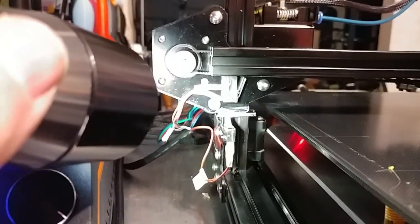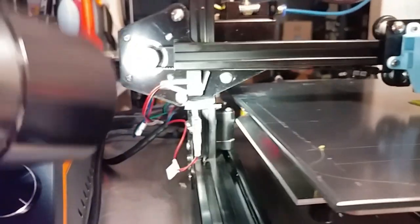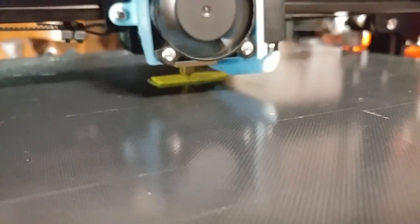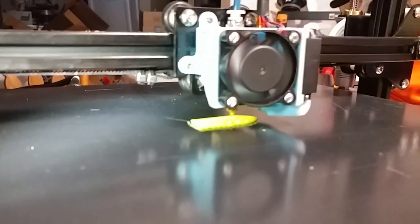So I added an additional 3 millimeters. So I've probably got like 6 or 7 millimeters of boost on my end stop, my Z axis, to clear the thicker plate, the spacers, and the Anycubic. But now it's working good. So you guys later will get to see the finished product of this. That's it. I will report back.